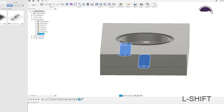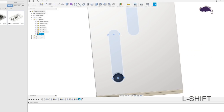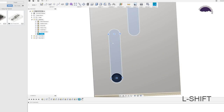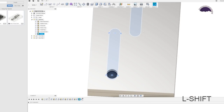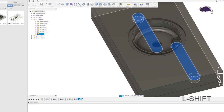So now we've got the basis for the pump mount. Notice I've kept the outlet channel on the left — because if you view a pump from the front it spins anti-clockwise, clockwise from the back, so you want the exit channel going like this, on the left. You can always adjust the orientation for different directions, but that's the standard orientation you want.